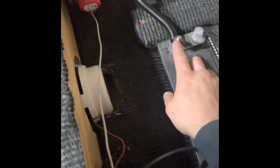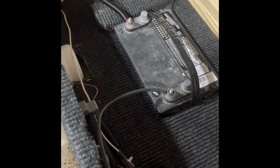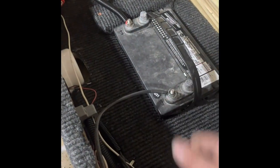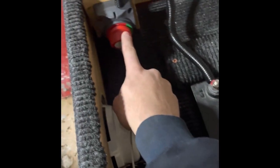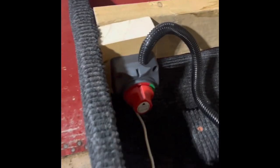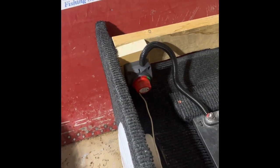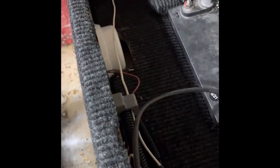Now let's go to the positive side. Since I'm only running a control panel, a radio, and maybe a bilge pump, that's not going to pull much. And think about distance — I'm not going far, so I don't have to worry about resistance or over-amping. Positive wire goes to a safety switch — right now I have it on so my power's on. I turn it off, power's off. What's great about that is I can isolate these batteries individually. When I charge my batteries, I don't have to worry because it stops there. Negative is earth — it's ground.